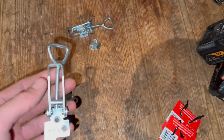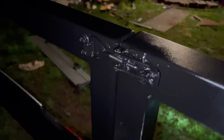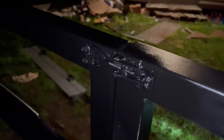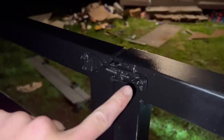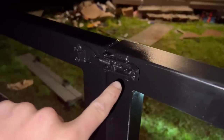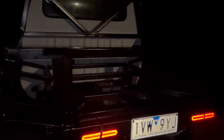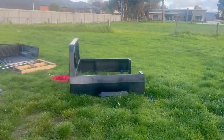I'm all done for tonight - I've got the latches on. What I ended up doing is tech-screwing it all on, but then the latch handle hit the tech screw head, so I ended up welding that on instead, then tech-screwing and painting it so it all blends in. It doesn't move at all now - it's nice and tight, so pretty happy with that.